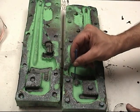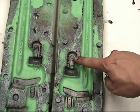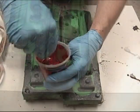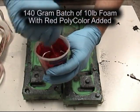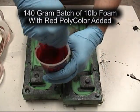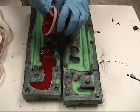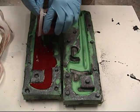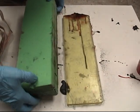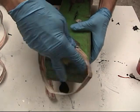Once we brush the powder into those areas, we're going to pour our foam. I want to explain what I call the waffle machine technique. We pour the foam first and then close the mold. We pour into the deeper side of the mold, filling up all those areas that otherwise we might not reach if pouring through the bottom. We fill up that first half, close it up, and flip it over. That allows the foam to sit in its liquid, unexpanded state on both halves of the mold, giving us a much better detailed surface.